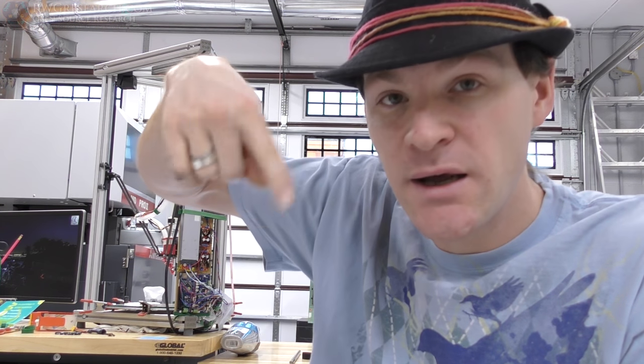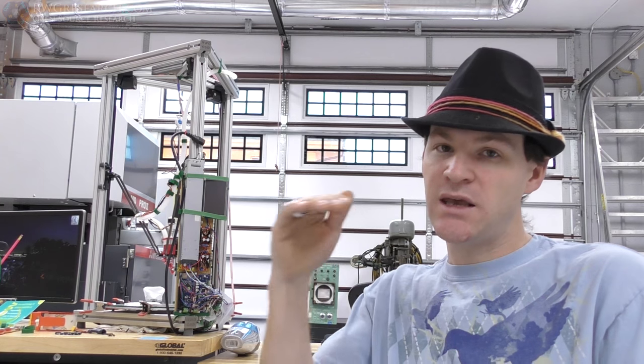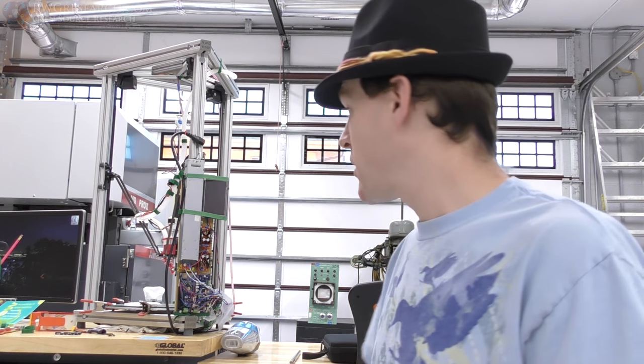And people make a really valid point. Crickets over there, and I'm glad that you guys did this because you made a valid point. The valid point is that when you're cutting at a certain RPM, if I go down or up 100 RPM, so that'd be like a 200 RPM range, let's just say, that could throw things off. The cutters are specific for a speed, for what material you're using, and if you're bogging the system down, it doesn't know it. And so you have to try to keep that constant speed, which is really just something I didn't even think of, but is very, very true.